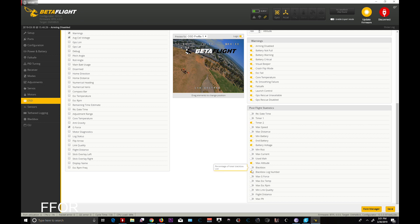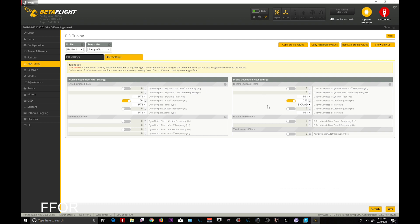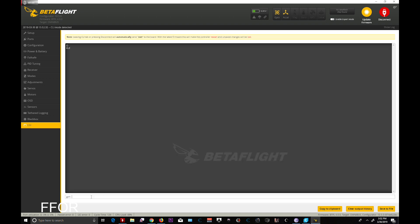Max Altitude — I don't have a black box. I do like Max G-Force and Max FFT to see my filters. So all in all, if you are updating on one of the F3 boards, PID tuning is going to be different and you're going to have a lot more settings. These are the settings I use and they fly phenomenally. 150 PT1 / 200 BiQuad — if you watch the diff live chat I have with the diff command, UAV Tech explains those very well in the chat. I'll put a link to that down below. The only other change we made was to set dynamic notch range to high — the default says auto — so you just want to set it to high, don't forget to save, and that is pretty much it. Let's go fly.